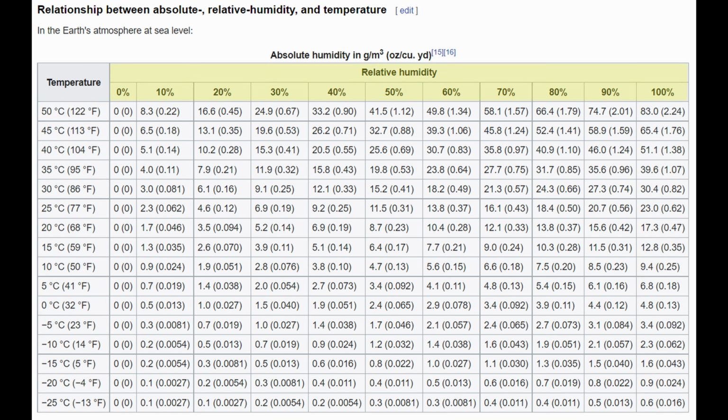Relative humidity, often expressed as a percentage, indicates a present state of absolute humidity relative to a maximum humidity given the same temperature. If you've ever been in super frigid temperatures, say minus 25 degrees C, and it felt really dry, it's because it is really dry, and the air at that temperature can barely hold any water vapor at all. This would be ideal conditions to test our devices, but it might be tricky to set them up with winter gloves on.